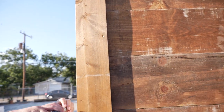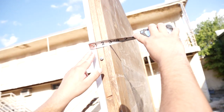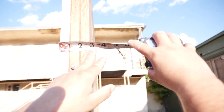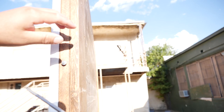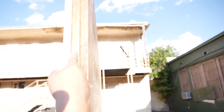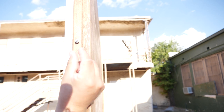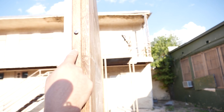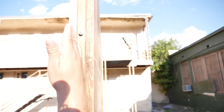So stacked together, the sides of this, in total, come out to 2.5 inches this way, 2.5 inches. And that's with the 1x6, 1x6, 1x3, and then those two masonite boards, the very thin plywood that I cut, the same size as the 1x3s, and that just gives that extra spacing so the boards can wiggle around a little bit so they don't get stuck.